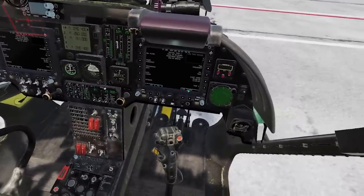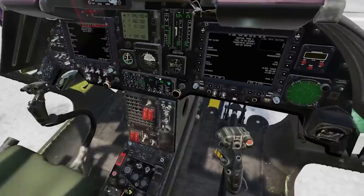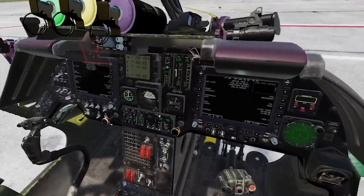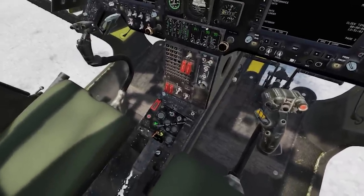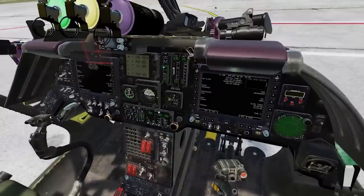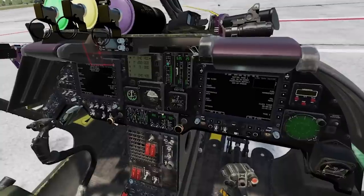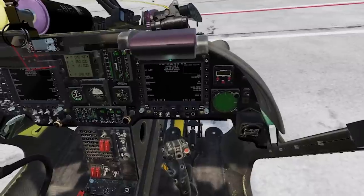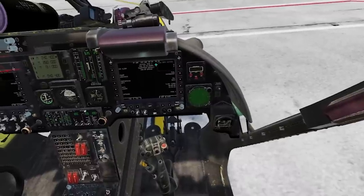As I open the throttle, NP rises which drags the main rotor along with it. NG is rising — there was a standard caution that comes up as I transition through various RPM ranges. AC gen and rectifier caution messages went away. Board is clean. I'll set my MPD selector to NR and NP speeds — this is the instrument I use to set my rotor RPM. I'm in between 97 and 100, and I want 100 before I go fly. I'll beep my NP trimmer — one, two, three beeps. NR and NP are now set at 100.